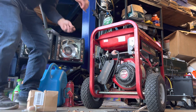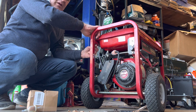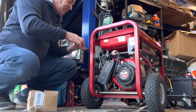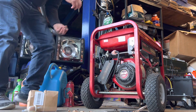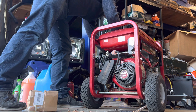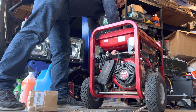I didn't notice there was no carburetor — believe it or not, I trusted the guy. Now the problem could have been: what if it didn't have output? That would have been a problem. So what I did was I plugged a lamp into it, and when it fired up on ether I saw the light come on. If that didn't light up, I wouldn't have continued. I would have either been honest and sold it cheap or just junked it — I wouldn't try to do what that guy did.